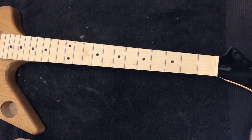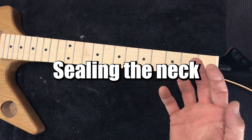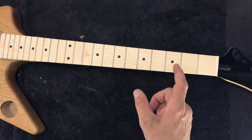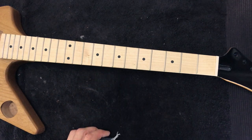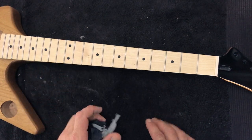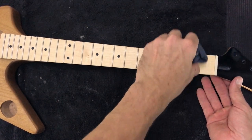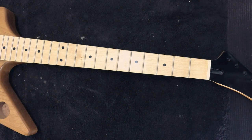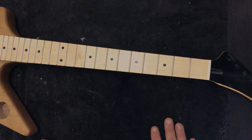We're just about through the finishing stage of our EXP guitar kit. The last thing we need to do is seal the neck — oils from our hands or dirt can end up on the fretboard. A maple fretboard like this needs to be sealed; rosewood fretboards typically are not sealed. I'm going to wipe on an oil directly onto the fretboard. It would be better to do this before the frets are in the neck, which is why this job is normally done beforehand. I'll come back in about 10 minutes and wipe away any excess, and may do a second coat as well.